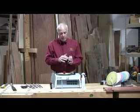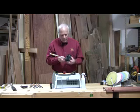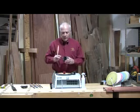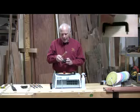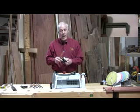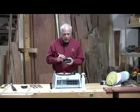It has an integrated reference bar. What we'll do is select the chisel and put it up against the reference bar. The reference bar has two positions: what's known as the zero-degree position, and if you turn the reference bar over, it has a stepped position where you add two and a half degrees to the reading on the side. We'll set it up so that we have the two and a half degrees and place the chisel correctly up against the reference bar.